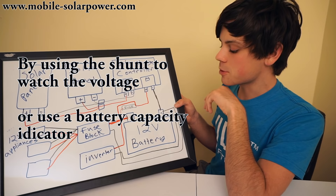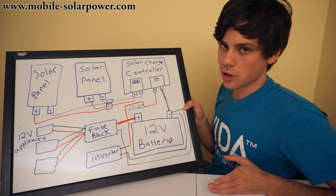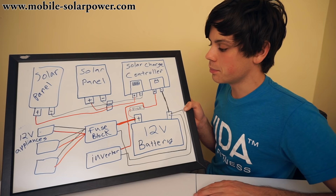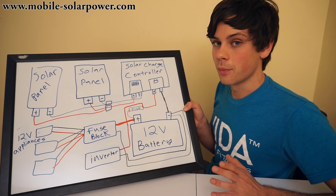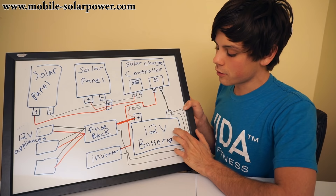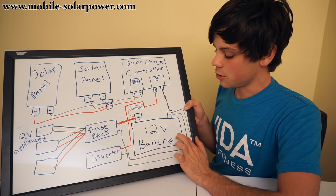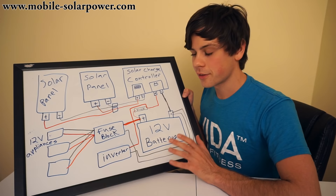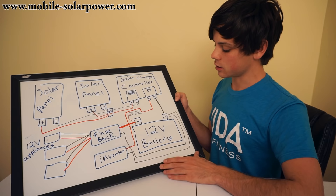A 12-volt battery when it's fully charged is going to be 12.6 volts — that means it's a full charge with a lot of potential energy. When it's around 11.6, it's completely depleted. Typically around 12.1 to 12.2 is very low for most solar batteries. I recommend people go down to 12.2 to 12.3 volts as a safe amount so that you do not damage the battery. If you over-discharge or use too much electricity from this battery, it will damage it no matter what kind of battery you have. A lithium battery typically has a system to monitor capacity, and when you run it too low, it will shut itself off from the appliances, which is very useful.